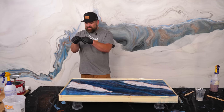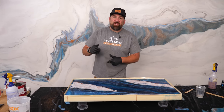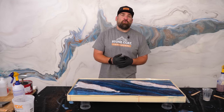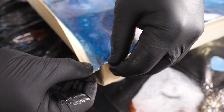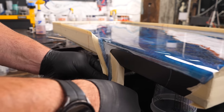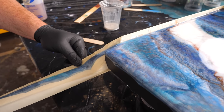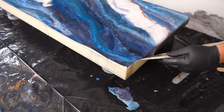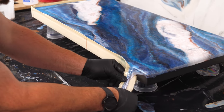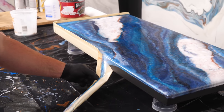To peel the tape, I like to start at the top and pull it down all the way off the edge. Then I'm going to use that tape to encourage the epoxy to start flowing over my edge by pulling down and away from the top of the countertop. Then I take my glove fingers and start to encourage that epoxy to flow uniformly over that edge. I kind of come in and just rip that tape at first, then walk it all the way down to take it off. I'll save this tape in case I have to apply any of this resin to the edges. No leaks though.